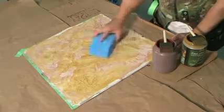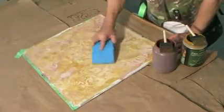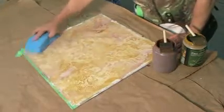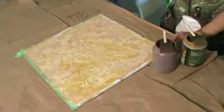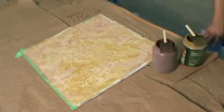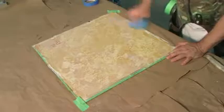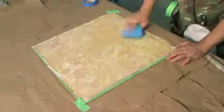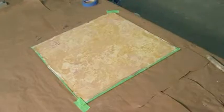After the second glaze application, take a dry, flat, dense sponge and lightly wipe and dab the glaze to blend and move the colors. This will unify your surface color. How much blending and removal of glaze depends on the amount of pressure applied. When the final application has fully dried, you may lightly run a sanding sponge across any stenciled relief areas to perfect the distressed appearance.